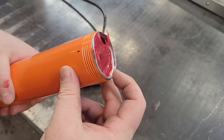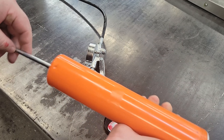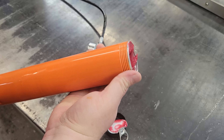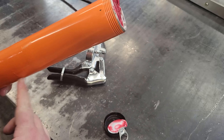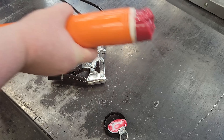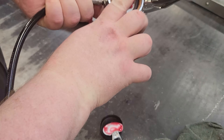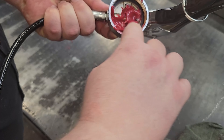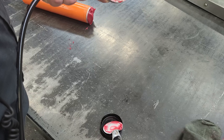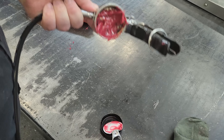There is a little bit of an air gap in there, and I want to try to release that. The way I'm going to do that is allow the piston to go in just a little bit. You've got to be real careful if you're going to try this, because it could just shoot all the grease right out. The thicker the grease, the harder it is. If you have air in there, it's just going to be pumping away and it won't be doing anything, because it's not actually moving anything — it's just pushing air.